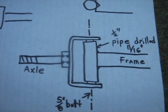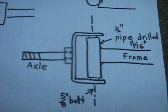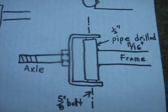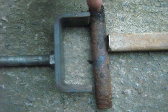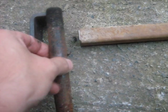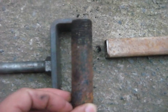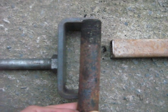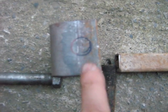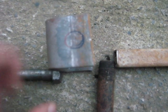It's a piece of 3 or 3-1/2-inch — they call it HSS — square metal tubing. And you slit it into a kind of a shape like I have here. This one's slit too much; it needs to be longer than that, about over here. Basically, your pipe will fit inside of that and be allowed to move. But you have to have enough room to get some edge distance from your bolt there. You might need maybe 2-1/2 to 3 inches here on this leg of it.